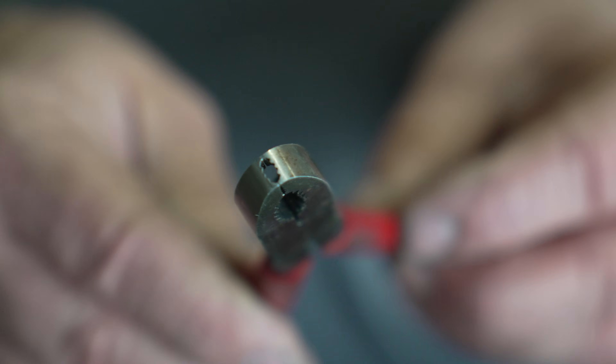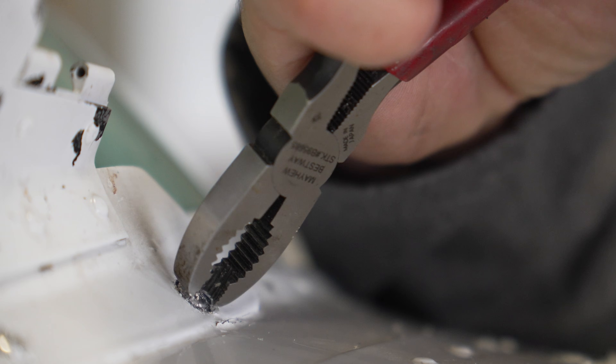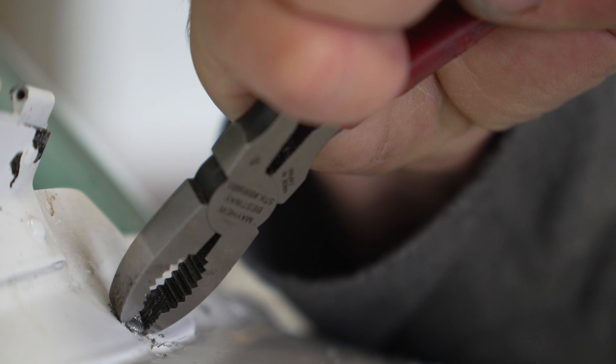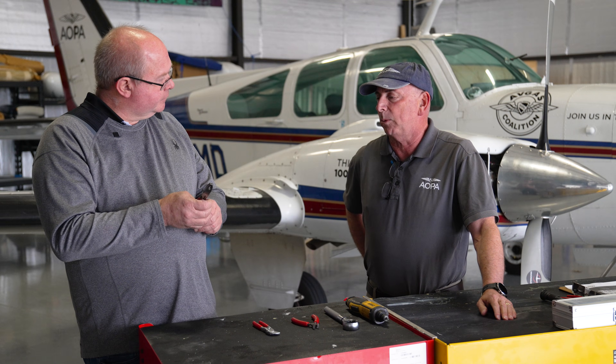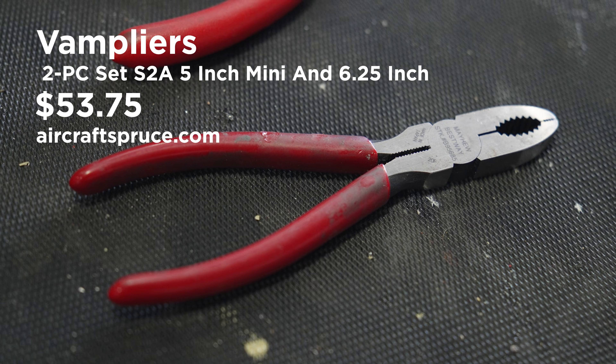This is another favorite of mine that didn't exist until quite recently. This is a Vamplier, made by the Vamplier company. It has teeth on the end of the jaws that allow you to grab a stubborn screw — specifically a round-head screw. If you have a flush-head screw, you've got other problems, but with a round-head screw, you can grab onto the very end of the screw hard and loosen it. I've had many a button-head screw that's been stubborn and stripped, and this has come to the rescue. What are the alternatives? Before this, I would have to take a grinder with a cut-off disc and make a slot for a flat screwdriver — sparks, heat, and the danger of slipping off and damaging the aircraft skin. So this is much, much safer. If it's really bad it may not work, but it's a godsend, and it's a fast-growing tool in the aviation maintenance world.